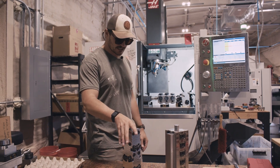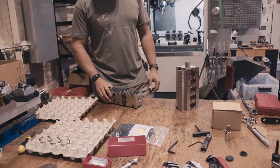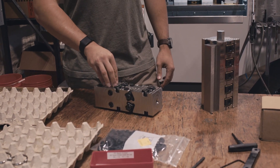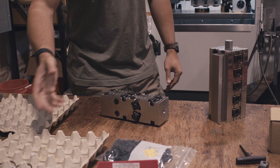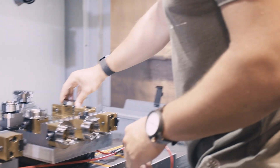Whereas this tombstone is made for prepping our case material. Generally speaking, we're putting big pucks of titanium in this. This can hold six pucks at a time and put dovetails in them so we can hold them on our case pallet in our VM2.